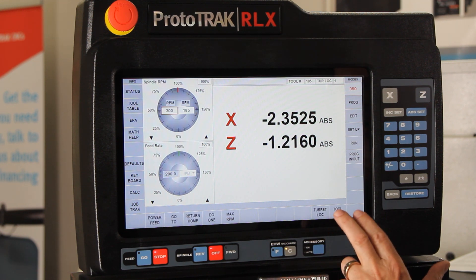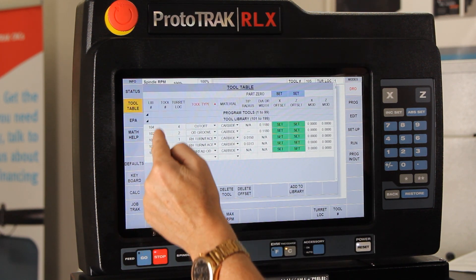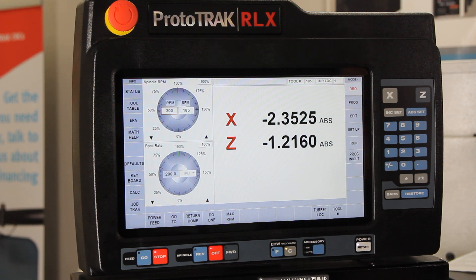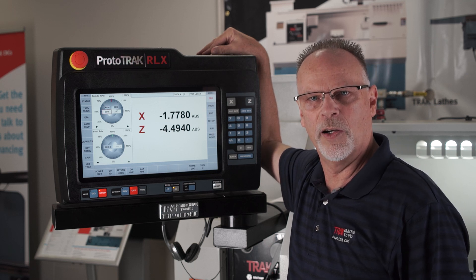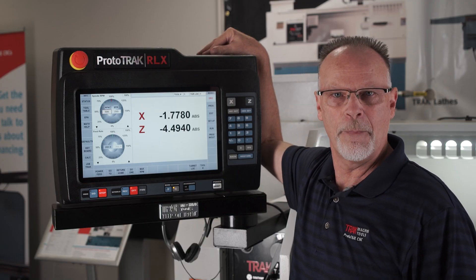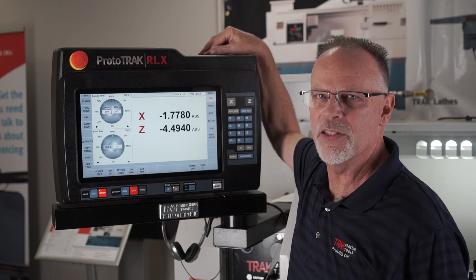The last thing in here is that I can turn the turret automatically if the machine has a turret, like this one does. I select which tool I'm going to use from the tool table — in this case my tools are 101 through 105, and in manual mode it's currently looking at 105. That gives you the basics of how the DRO mode works. It's quite simple, but this refresher gives you an idea of how to do things manually and set up your parts. There are a lot of neat things you can do in the manual part of this control. Hopefully what you've learned will be beneficial and remind you of things you can use in day-to-day operations. Thank you for watching — I'll see you in the next video. As always, keep on tracking.